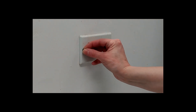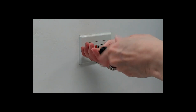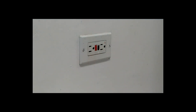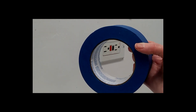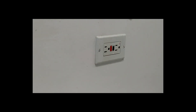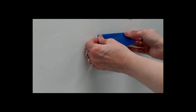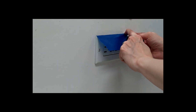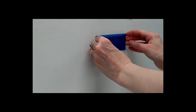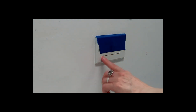Like I said, there are some things you're not going to be able to remove, but you're still going to want to protect them. This is one of those things. This is frog tape, or painter's tape, and I'm going to use this to cover the outlet. It's really easy to use — you just pull up the amount that you need, tear it off, and apply it where you need it. I'm making sure that I'm very careful to go around the edges so that it's totally protective from any paint that might come along the seam.